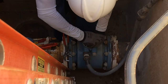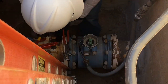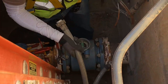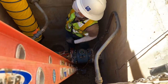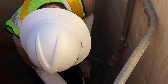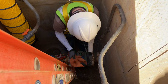Resuming where we left off, the wire terminals need to be loosened to allow the individual wires to be pulled free of the old flow tube. The flexible metal conduit is then removed as well. The wires will need to be pulled through a new short section of flexible metal conduit, which will be sealed at the point on the wall where it joins with the rigid conduit, and also on the flow tube where the wires enter the terminal case. The existing wire jackets are to be wiped and cleaned beforehand, so that the outer jacket and wires can be cut and stripped to expose new conductors that will be landed on the new flow tube terminals once it has been installed.